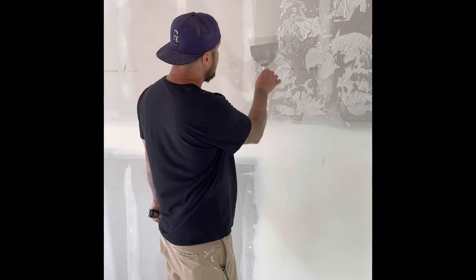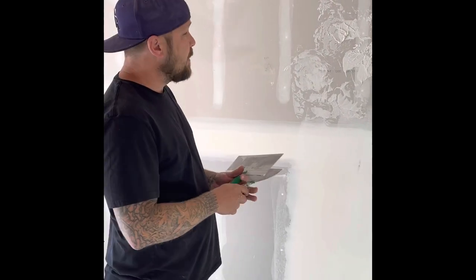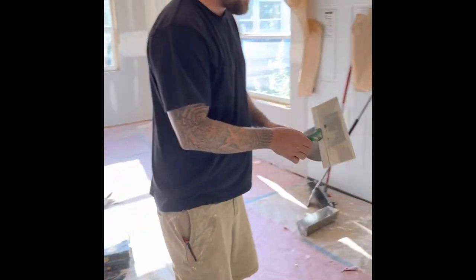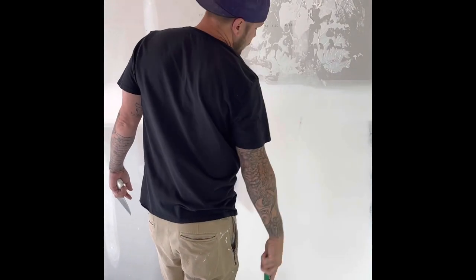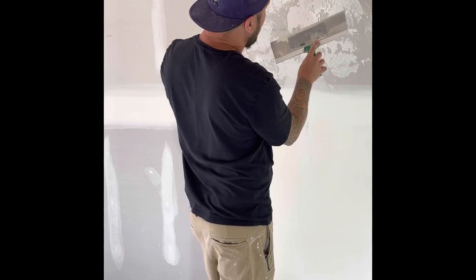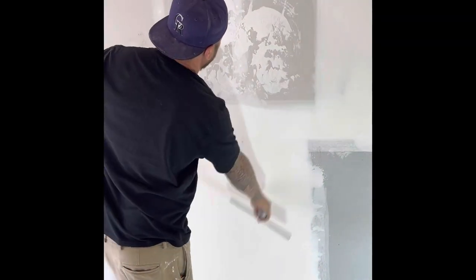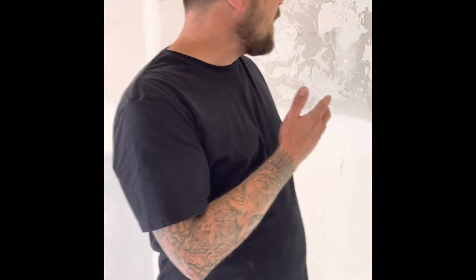To test if it's ready, just do a little test — apply no pressure, just take it and wipe it. That's exactly what I want. Now I'm going to take my knockdown tool. You can use this, or there are other knockdown tools — they make them this big, and even bigger. I just use my 14-inch knife. I start here and give it just a light knockdown — you don't want hardly any mud on your knife. I put a little pressure to the right, no pressure at all on the left, so I don't leave a line. That is exactly what you're looking for in a brocade knockdown. Thank you for watching — like and subscribe, more easy textures and fixes coming your way.